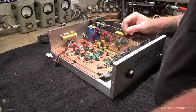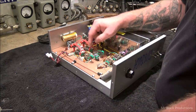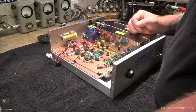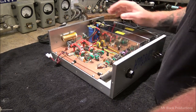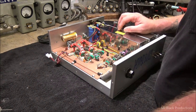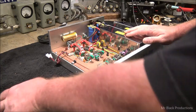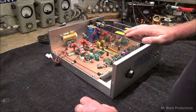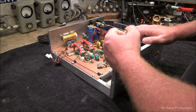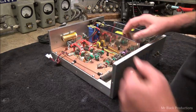Now, what you have to think is each transistor pulls roughly 20, 25 amps worth of current. Well, 20, 50, 75, 100. We have 100 amps for the power supply, but we still have a whole other transistor over here. So we do have a good filtering bank system in this that was added. And the questionable link is these two units. When I add bias to this, it makes the amplifier pull even more current. Where we're pulling the least amount of current is in class C mode, where it's at now, 100% to ground with these little chokes.